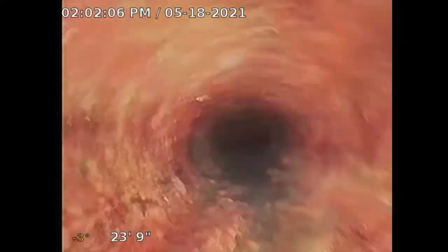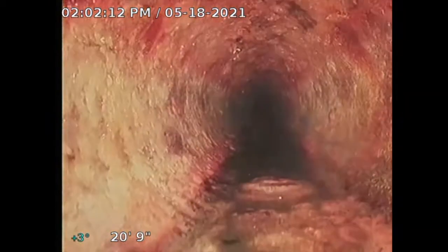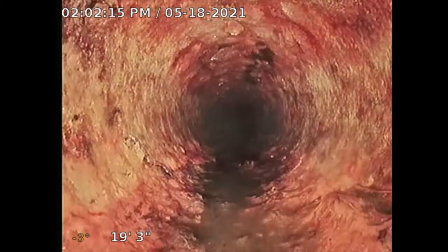Now I'm just backing up, taking out my camera. This is normal wear and tear corrosion from the cast iron — looks okay. The only issue was with that clay pipe in front of the property. There's no tree in front of the house but it may have been removed. There is visible blockage that might backflow if multiple people are using the bathroom at the same time. I'll set the report, send it, and give me a call if you have any questions. Thanks again.